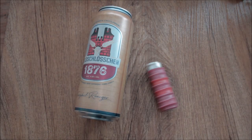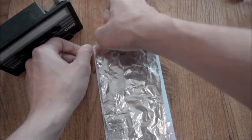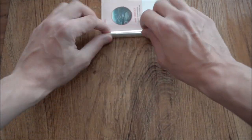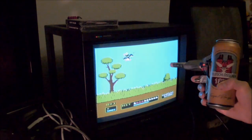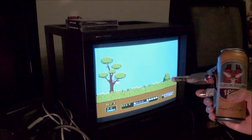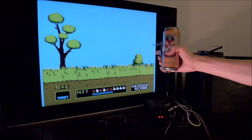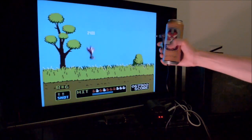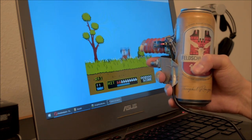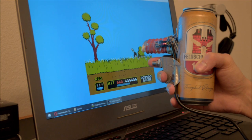Anything can be a light gun. To exemplify this I chose to use a can of beer, a lighter, and a cherry snap action switch — everything held together by duct tape. Using a lens would be ideal, but to keep it simple I built a light-proof aperture, which increases precision at sufficiently bright displays such as CRTs. I taped aluminum foil to a sheet of paper and wrapped it into a tube — it worked surprisingly well. However, with dimmer LCD displays a lens is highly recommended, and without one a barrel takes away too much light. To quickly test the cheap sensor board with the USB adapter I removed the barrel for better results. Potentiometer guns in general were more finicky to dial in on the original PC adapter design, and setting up the AliExpress board with its start-and-stopless potentiometer isn't a great experience.